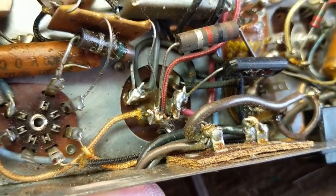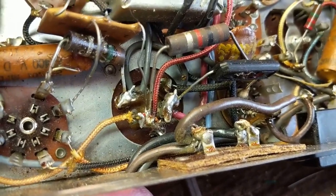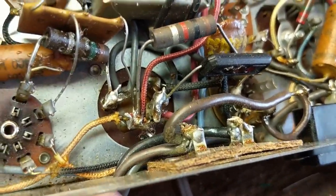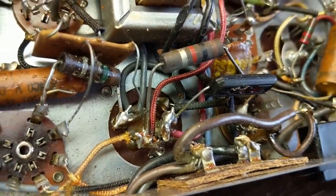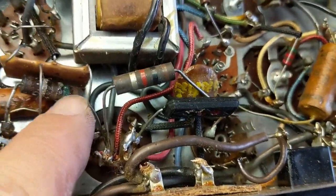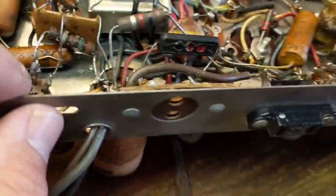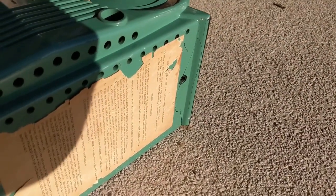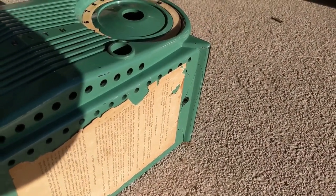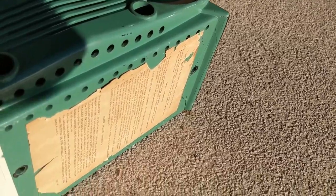I cut the replacement capacitor out of there and we're going to replace both of these values — there's an 80 and a 40 microfarad. There's a ton of little leads going in there so it's going to be all kinds of fun. Looks like this resistor got nice and bubbly hot with all the crispy bubbles on it. Meanwhile the case — I used some super glue to fix the big crack on the bottom, and here it is all glued back together. Unless someone flips it over, they're never going to know it exists at all.